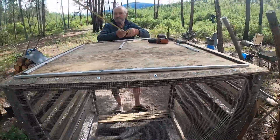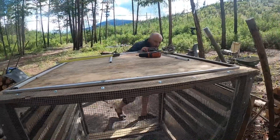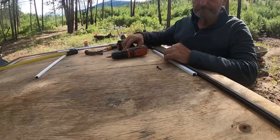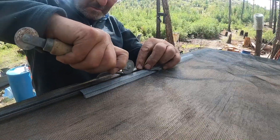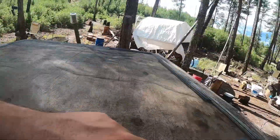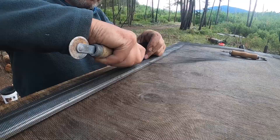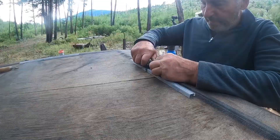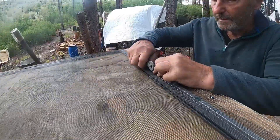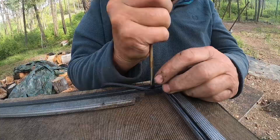This is making the door out of the screens. From experience I know that tightening the screens up will warp the sides of it, so I'm putting stabilizers in to keep the side from bending when I tighten the screen up. This is running the spine into the holes — I put a little bit on each side to hold it in place and take them out while I finish putting the whole spine in. The tighter you get it, the better.